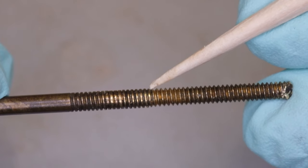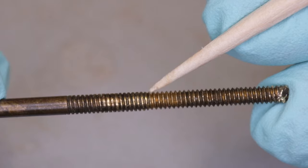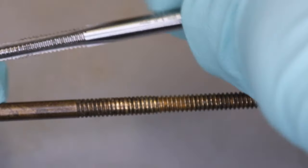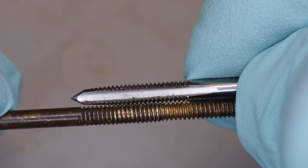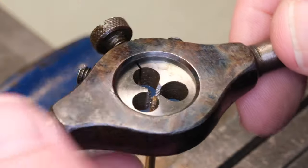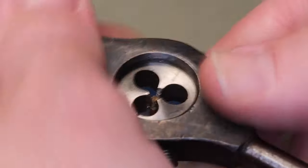I find that the rating thread, that's the regulating mechanism, if you like, has been cut to a smaller diameter thread for about half its length. So I decided to cut this section off and drill it out and make a new piece of threaded rod that matches, best I can, the original thread. Then I make a new knurled rating nut for regulating the clock.